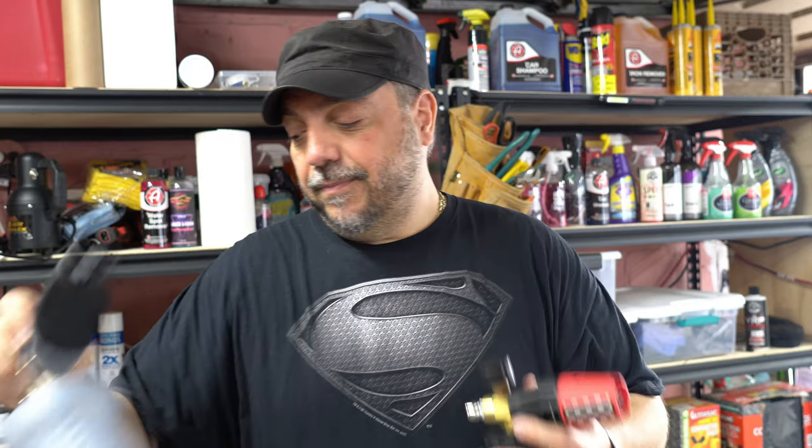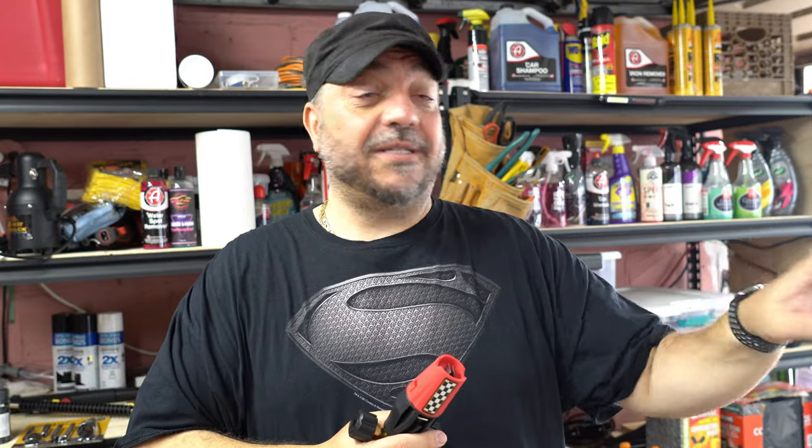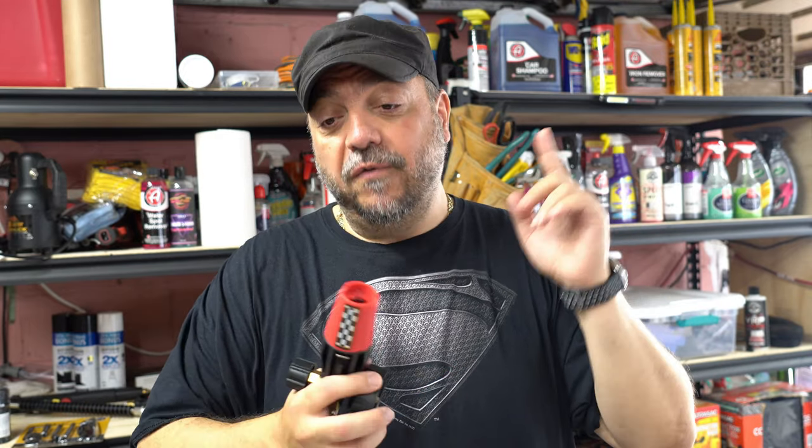A lot of companies actually ship it out with both orifices in there, 1.1 and 1.25. They only give you the 1.1. For me, that's perfect because that's what I use for the stuff I have. But for you guys out there, you would need a 1.25 if you want to use this with, let's say, a gas power washer, something that shoots out a lot of water, a lot of GPM, gallons per minute. So I'll have a link in the description for a 1.25 orifice, or if you're looking for another pressure washer nozzle, a 1.1 millimeter, I'll have that linked also down below.